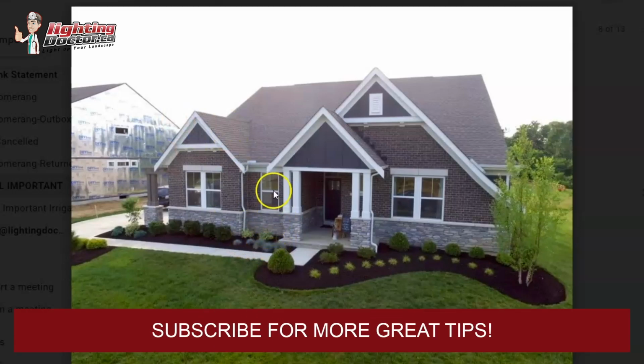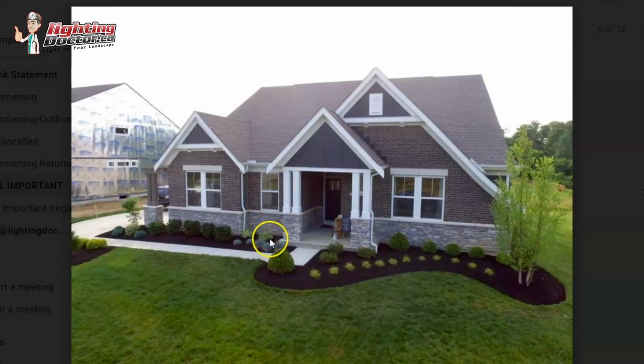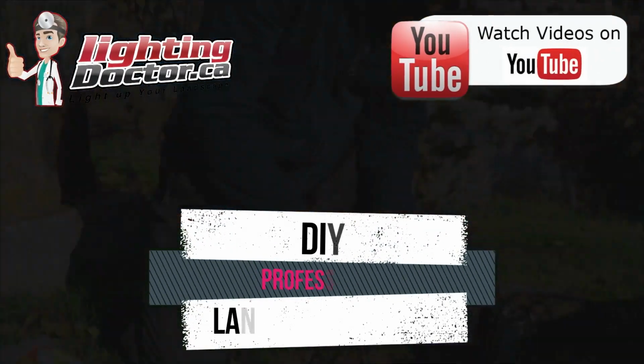To avoid having a dark corner back here, I would try and have another one of those uplights, again just at the base here, shining up, that highlights this whole section in this bottom brick area. I always like to especially highlight the front entryway and really make it pop with a couple of accent lights here.